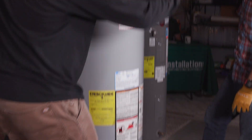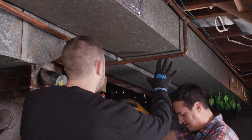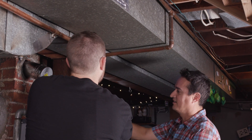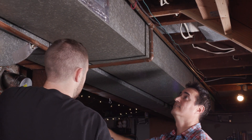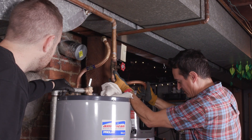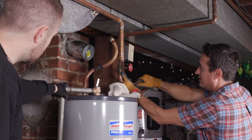Just a reminder — see how all this pipe is in this position right here? Make sure when we bend this downhill, we try to keep it where it's at, because if you start bending it we're starting to jeopardize these fittings. We don't want to break that solder loose or anything like that. I just wanted to face this downhill a little to drain it better.